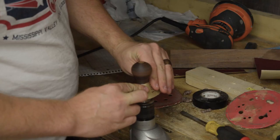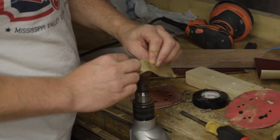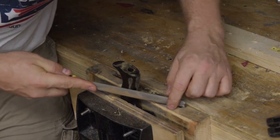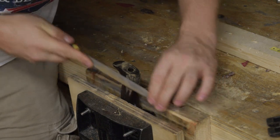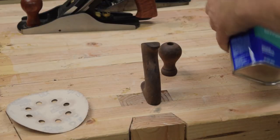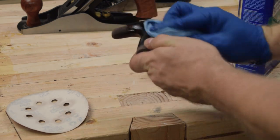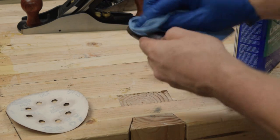The sand didn't help a lot — it had a lot of finish on it, but got through it a little bit quicker. The back tote I hit with a rasp to break up the finish and all the hand oil that was over it from all those years of use. After a lot of time and sandpaper, I was able to put on a coat of boiled linseed oil. They turned a little darker than I would have liked, but they looked great.